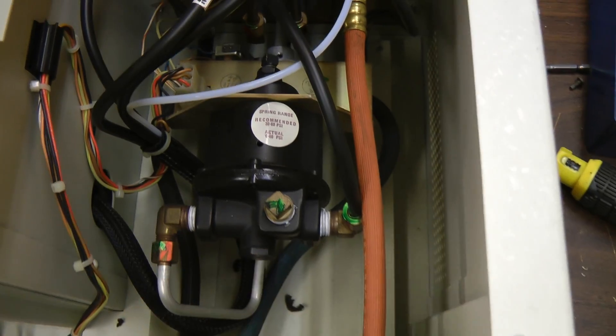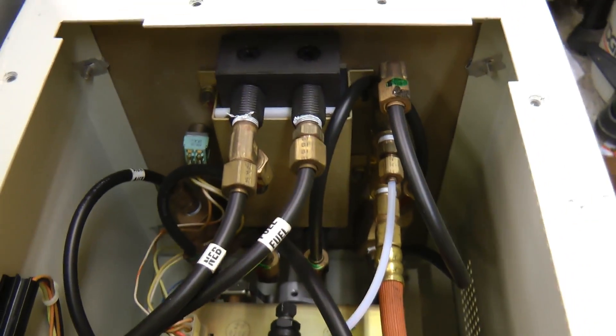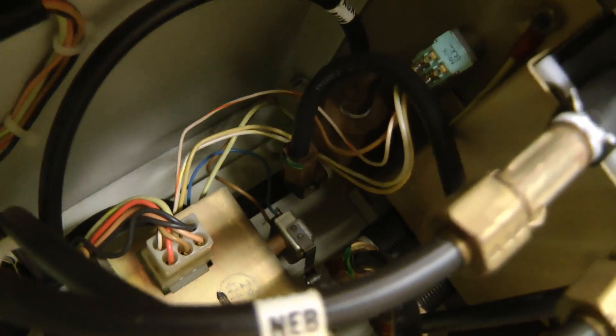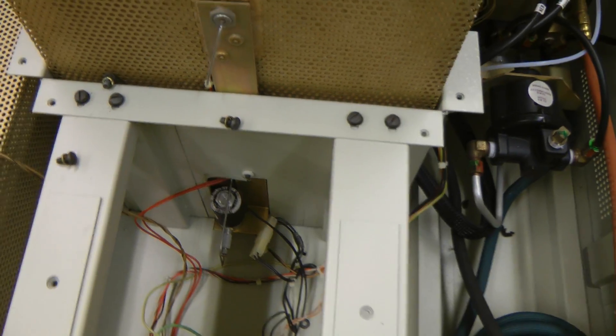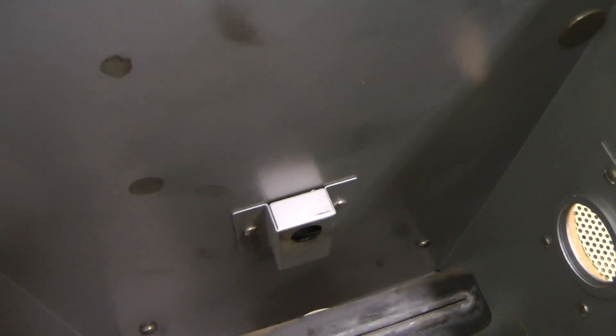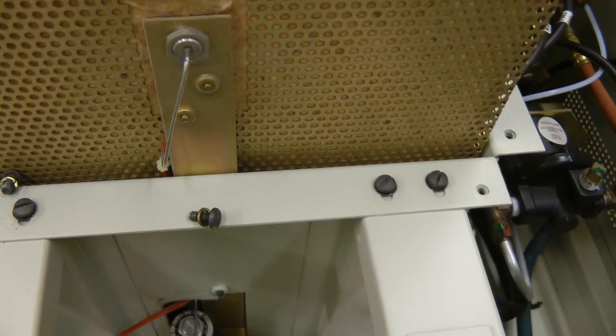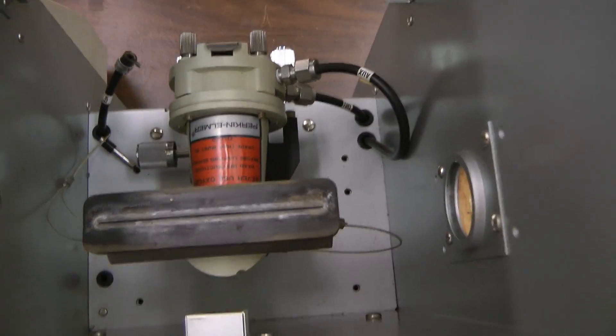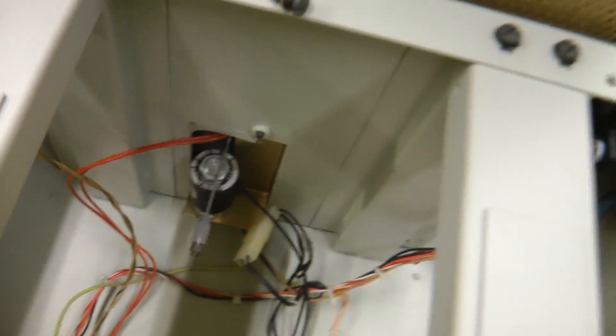On the plumbing side here we have what looks like a regulator for the air input, and just a couple of valves and the flow meters. There's a switch on one of these controls. It looks like this igniter just consists of a glow plug and a little jet of fuel coming out of this tube. The fuel jets over the glow plug, ignites it, then the flame goes across and lights the main burner. That's the solenoid valve that controls that.